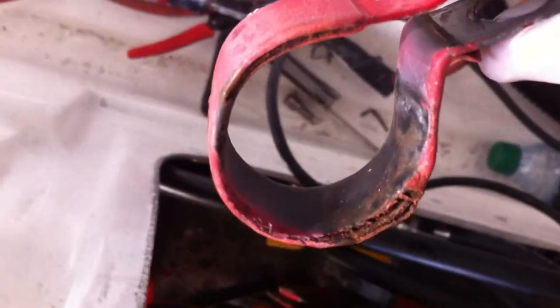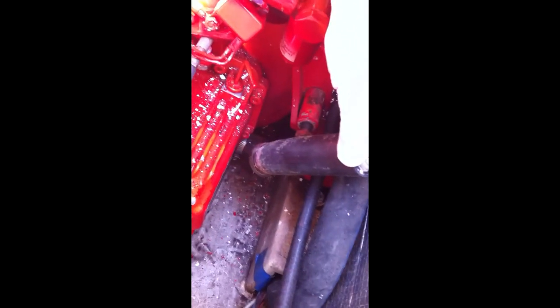This is the bracket for the hose in the back, and this is the one that goes down to the raw water exchanger. It's a little bit rusty on one part - looks like the chafing guard kind of came off. Maybe I can re-coat it, maybe I'll get a new one. I've got to get what's left of that hose out down there. I got the bracket off the engine mount that holds the hose, now I've got to get down to the bottom. The hose clamp is accessible way down there, so I'm going to try to get that hose clamp off, get the heat gun down there, and pull this hose off.